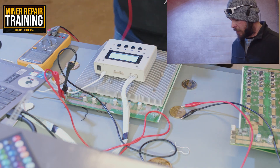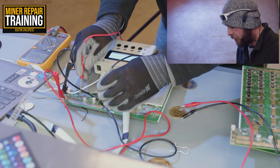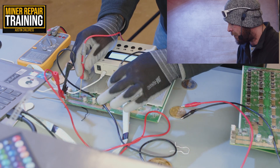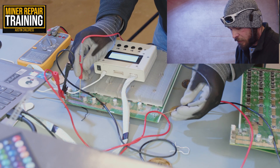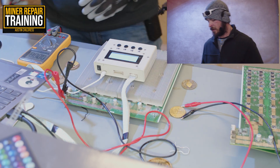We can come back and check the voltage coming in. The only difference between using your positive and negative leads on the different spots is that it just comes out negative after the MOSFET. Then we can test the boost. After that, we'd have to start taking off the plate and testing other things.